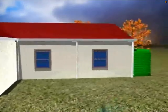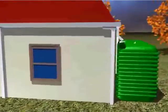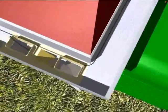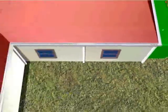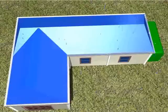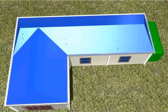With the installation of Rain IQ, low rainwater yields from small roof catchment areas and wet system installations become a thing of the past. Rain IQ downpipe diverters are installed onto each downpipe around the perimeter of the gutter, positioned between the gutter and the downpipe. This enables the ability to capture up to 100% of the total roof area and increase rainwater yield without the need of installing additional underground pipework around the home.